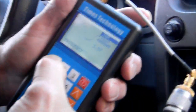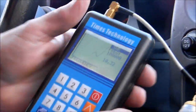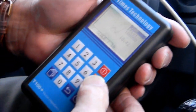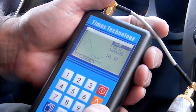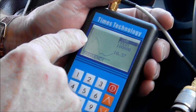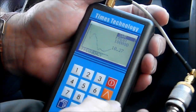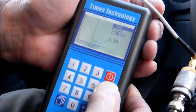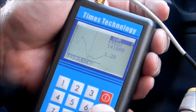I'll start out with 100 megahertz. The way this works is you see a little plot there. You can change the scale — we're on 3 now, let's go to 10 if it looks a little better. So the frequency is scanning from 100 to 170 megahertz. If I press and hold this you'll see that vertical line coming across, and at a low point right there our SWR is 1.2, so it's almost perfect.